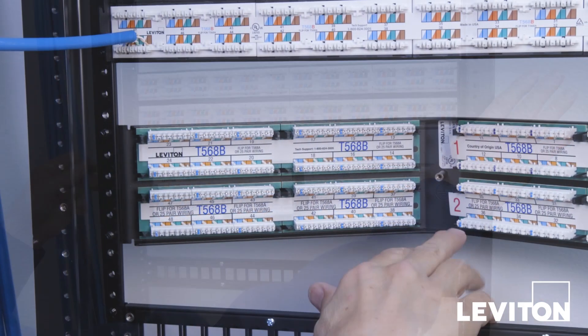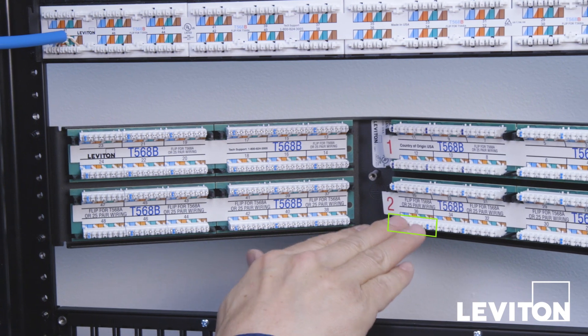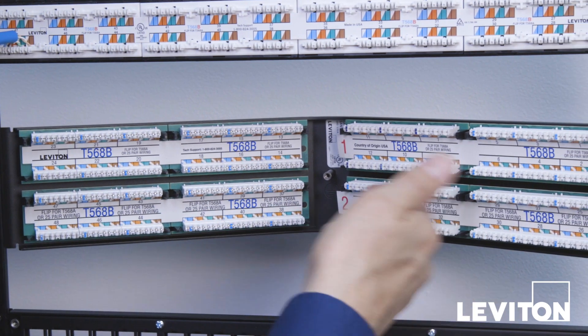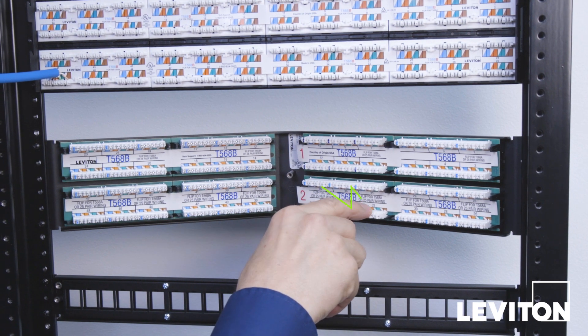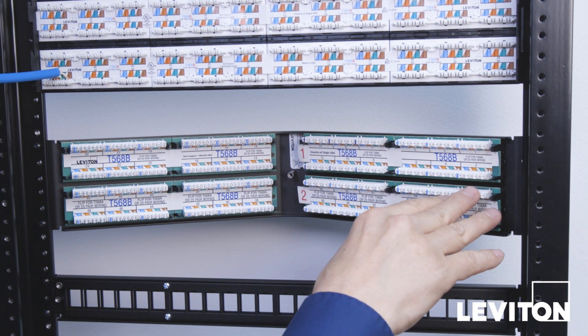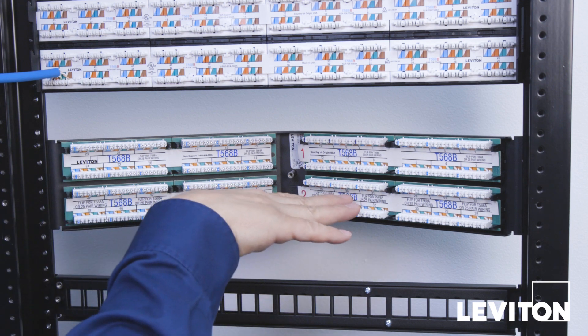As an overview, we'll start on the bottom module terminating the inboard bottom section of the IDCs, followed by the inboard upper section. Follow this zigzag pattern until all the cables fan outwards and lay nicely over the inner cables.